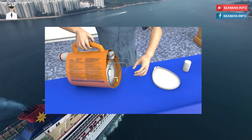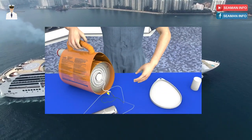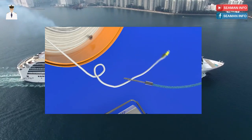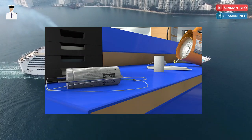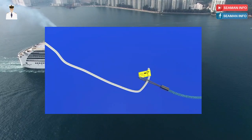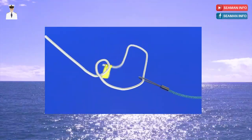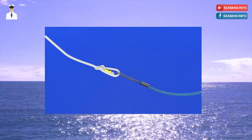Pull the rocket out of its shaft using the pull jack wires. Untie the line from the end of the rocket wire. Put the old rocket to one side to avoid mixing up the old and new. Tie the free end of the coiled line marked with a label to the wire of the new rocket using a bowline knot. Make sure it is tightly knotted.